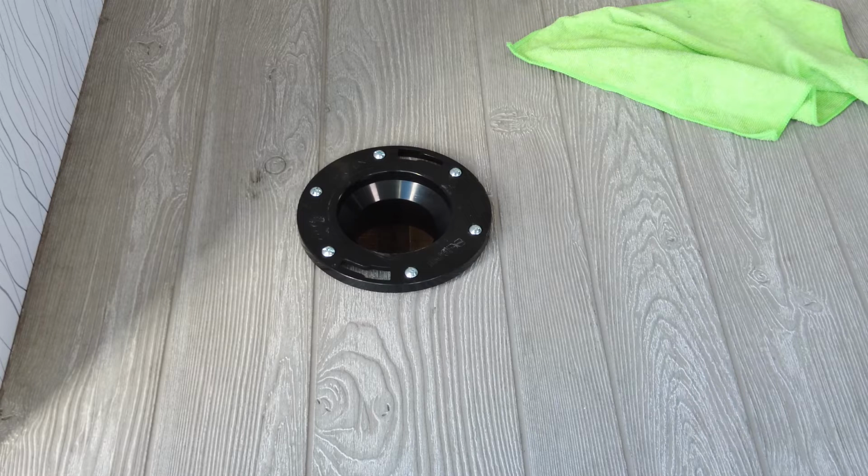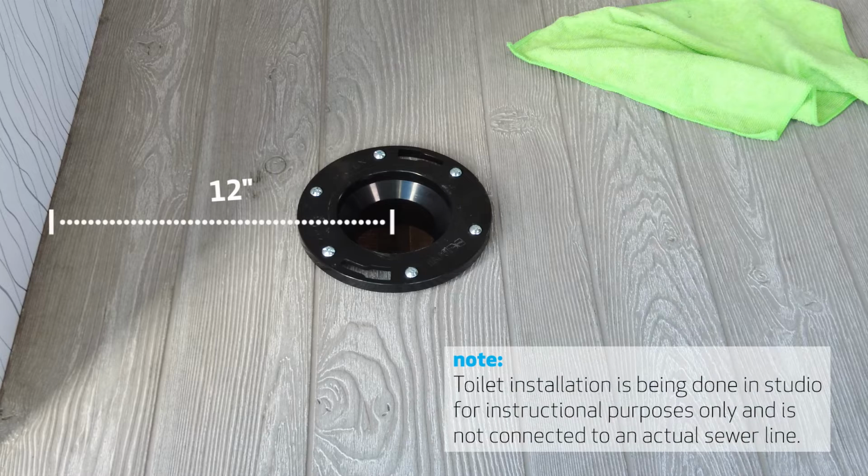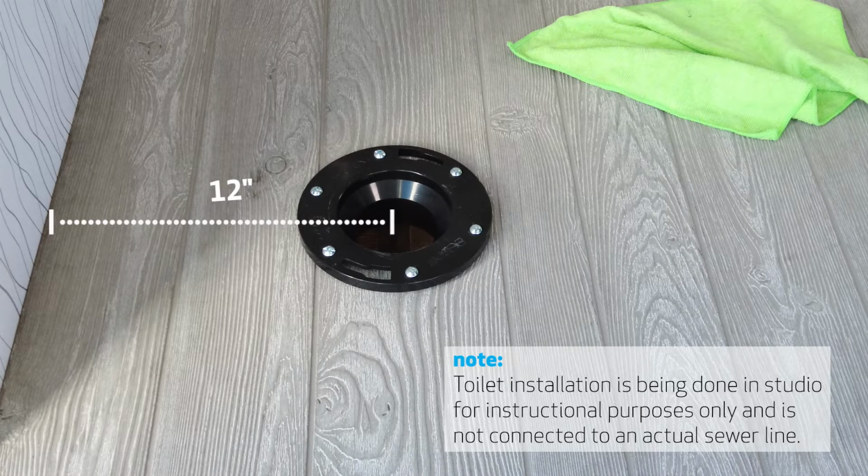Your first step is to ensure that the closet flange is set out accurately from the finished wall. This means that the center of the rough-in should be 12 inches from the finished wall. If you've installed a thick baseboard or tile after the flange was roughed in, you may need a toilet with a 10-inch rough-in. Any Caroma toilets utilizing the Smart Connect installation will adapt to a rough-in between 10 inches and 12 inches. We've linked information on Smart Connect in the description below, but for this toilet, the rough-in has to be 12 inches from the finished wall.